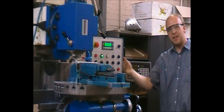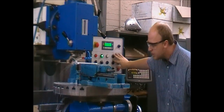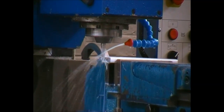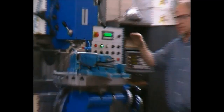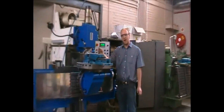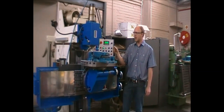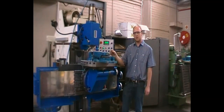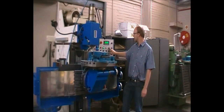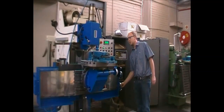Once we reach a depth of 40, let's first hit the height. We will set that to zero once it has touched on top. Please note — we are not going to take a full dip as this is too large for the slot we are making. Never take more than half the diameter of the cutter in depth. In this instance we will take a cut of 5 millimeters, set manually.